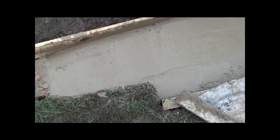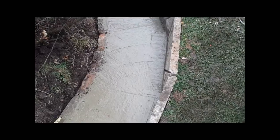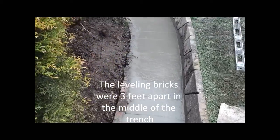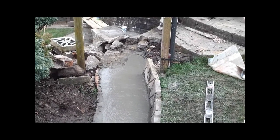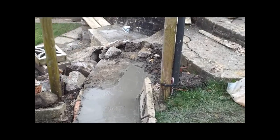Back from the bit where I've just finished. Just brought the concrete to here, about 4 or 5 mixer fulls. I've just brought the concrete along the trench to the levelling bricks each time. I've removed the bricks mostly - I've only left one in as I've come along. So if the bricks were in the right place then it should be level.